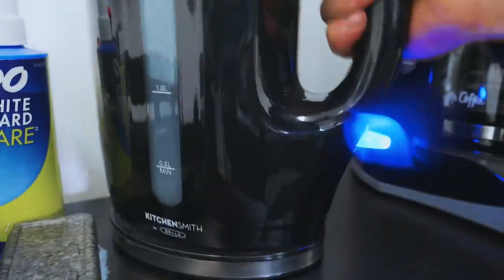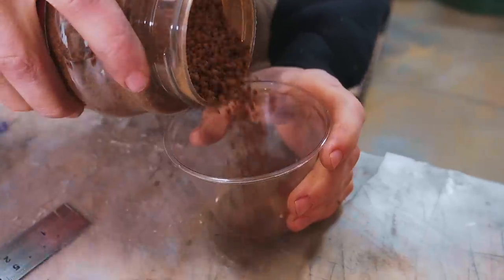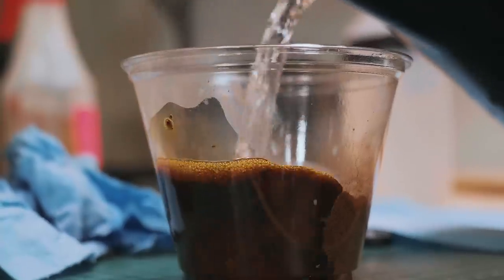Will is quite fond of the coffee etch — you take some instant coffee, put it in boiling water, and dunk your Damascus piece in it to get extra contrast after the ferric chloride etch. It's really an after-treatment to get those deep blacks in there. I'm going to fill up a kettle, get it boiling, grab a little container and some cheap instant coffee — one quarter cup — scrub it with 2500 grit, clean it off with acetone, then put the ring in.